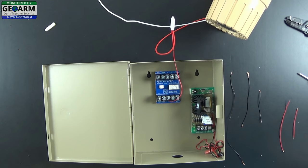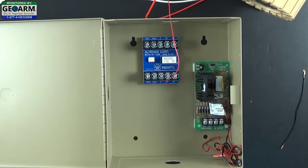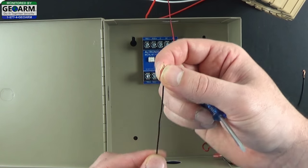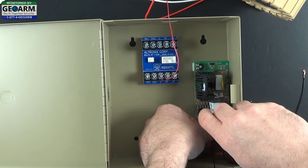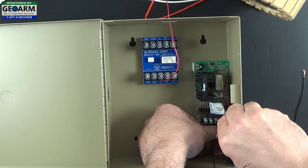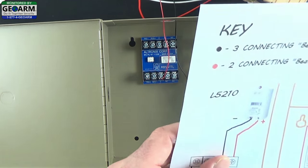The next thing we're going to do is run the DC minus and connect the wires into the actual 702 siren. With your Phillips head screwdriver, locate the DC minus terminal. Unscrew that terminal just enough so you can get the small end of the wire in - remember on these ends not leading out of the box you want a little less copper exposed. Slide that into its terminal and close it up. Make it pretty tight so you never have to worry about the connection. This end will be running outside of the box.